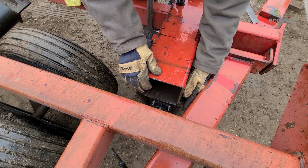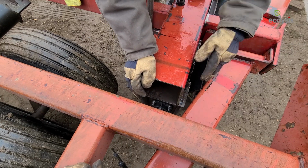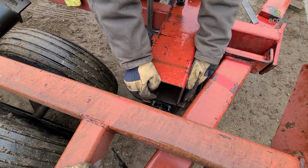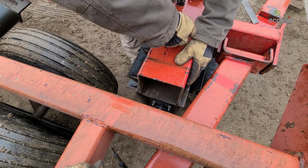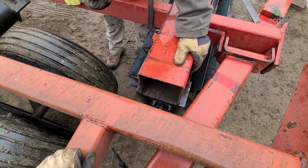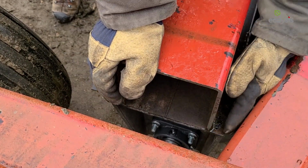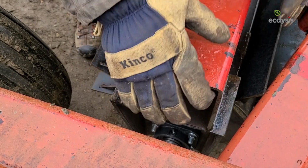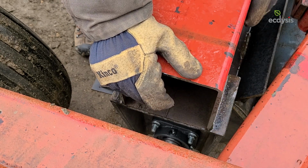And we have to make sure that with all articulations, with the wing going down and with us folding up, we don't have any part of the frame or the drum itself hindering the normal operation of folding, or if the wing is even in a more downward angled position out in the field, such as along a ditch or in a waterway. Okay? Which is exactly why we've left a good amount of space that we're comfortable with here between our articulating component here, our wing, and the rigid frame, the central frame.